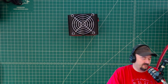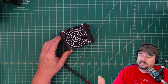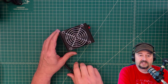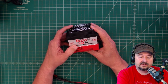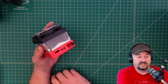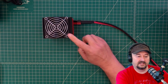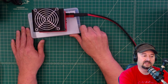I had charged this battery up and when I took it off the charger it was around 14.4. I let it sit for two days for everything to settle down. For the test we're going to use the West Mountain CBA 4 battery analyzer. You just take your power pole connections and hook it up, plug it in — this does get a little warm, so we put something on top for ventilation — and then connect a USB cable from our computer.